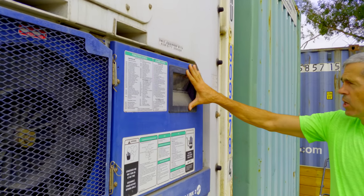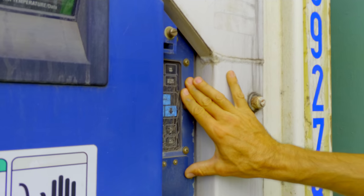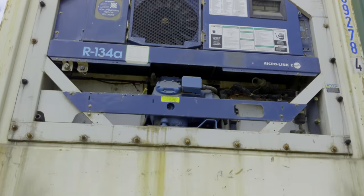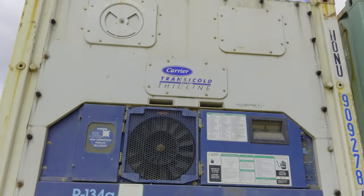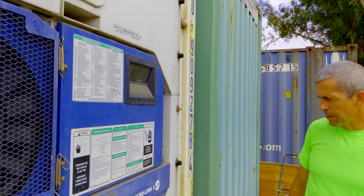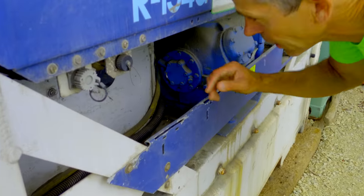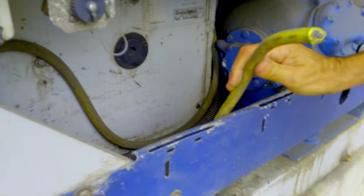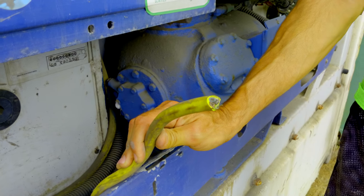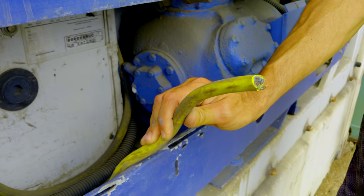You've got your controls and readout here — right here is the control panel. If we were to be using this unit, it would require 440 to 460 volts. The amperage — you'd want to have it hooked up to something with a 35-amp breaker. There's what they call a shore plug. It should be right about here — they've cut it off already. But basically that's the shore plug, that's what you would tie into your junction box or panel with a 35-amp breaker and you'd be good to go. You could also just get another outlet or plug for that and then plug it in.